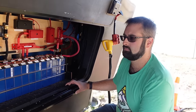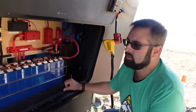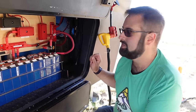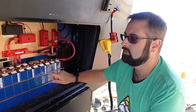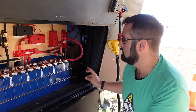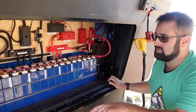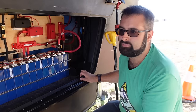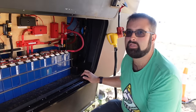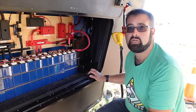A question that's going to pop up in the comments: you just said there are basically four 12-volt batteries here, so why didn't you just do four Battleborns and then another four up top? What we have between this battery, that battery, and the 12-volt battery in the case back here — which is just another four of these, a custom-built 12-volt battery with a BMS — is 2,070 amp hours equivalent at 12 volts for all three of these. It's about 26 kilowatt hours of battery power storage. It's about 21 of the standard Battleborn batteries.